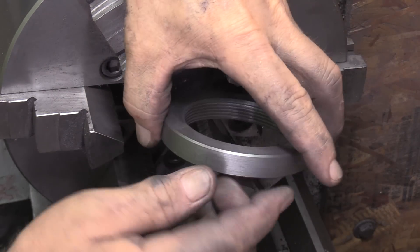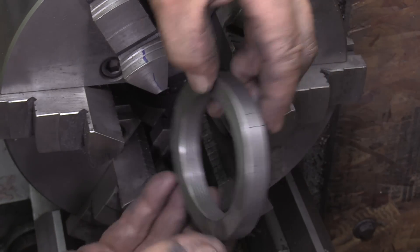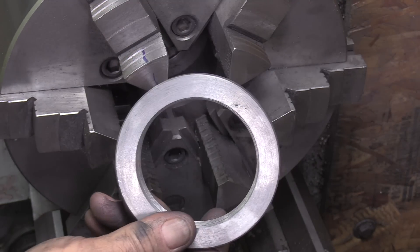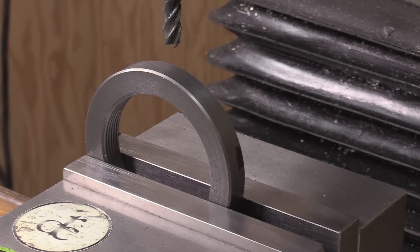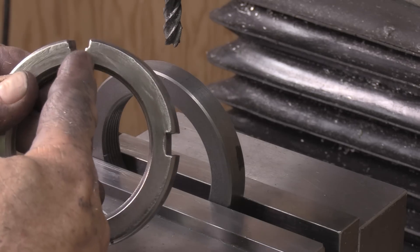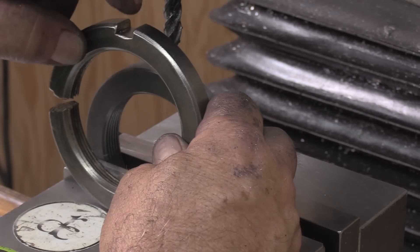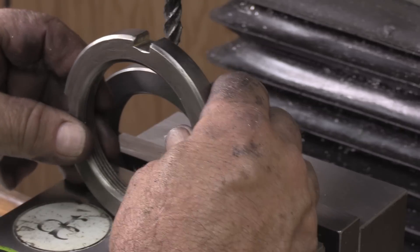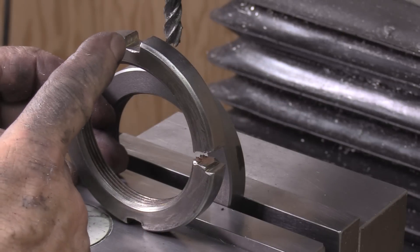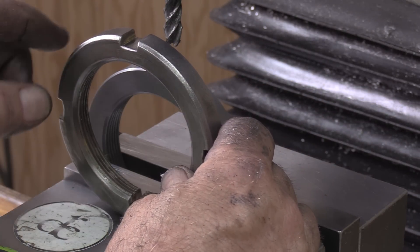There we go. Now we'll just mill the slots — and I think we'll charge about five hundred dollars. All right, I need to put these four notches in there. I'm going to mill that one, then rotate it 90 degrees. I have a little flat parallel down in there — I'll set that on to register it, then just kind of guess a little bit and get 90 degrees so I can do the other two.